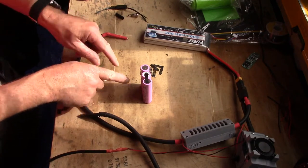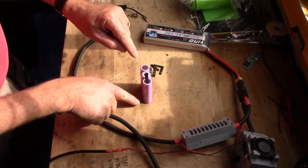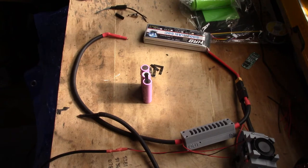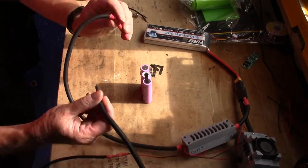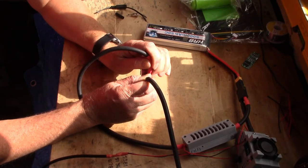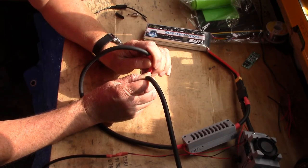This is the second side, so we bridge that side. Now we're bridging this side to get 12 volts between there and there. Now if you just watch those cables there, if you can see them, just let me check. Oh yeah, you can see them. Just watch those cables there when I press this switch. So put the probes on, maybe 2-3 mil apart. You see them? See it flexing? There's about 200 amps going through there.